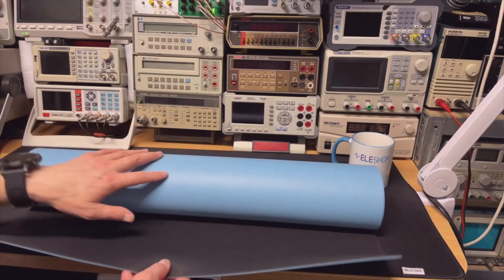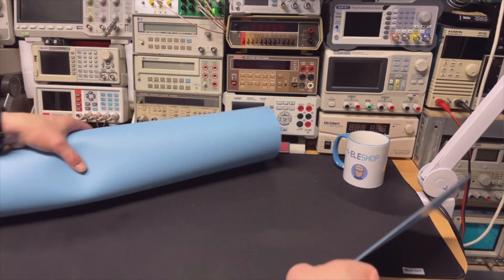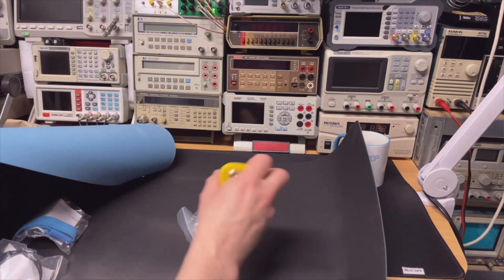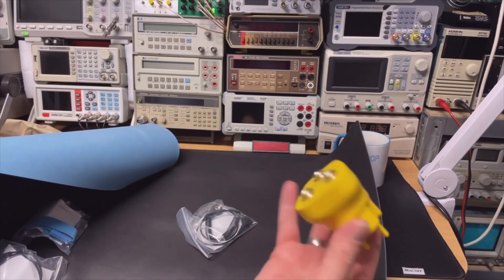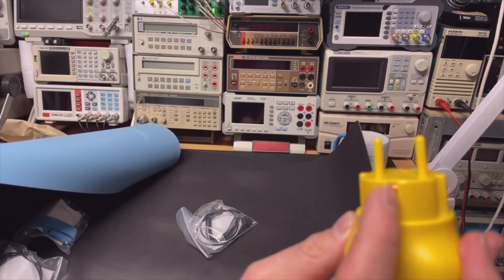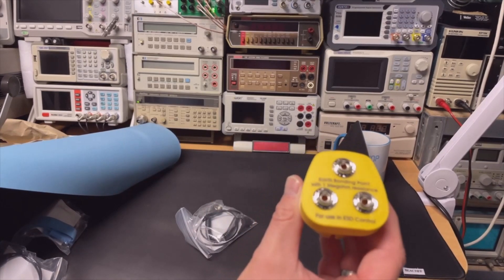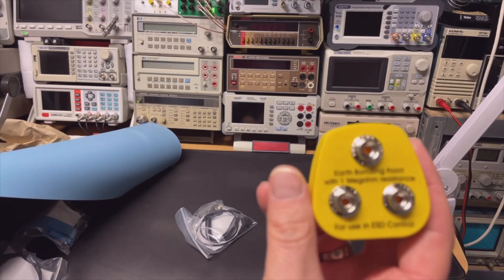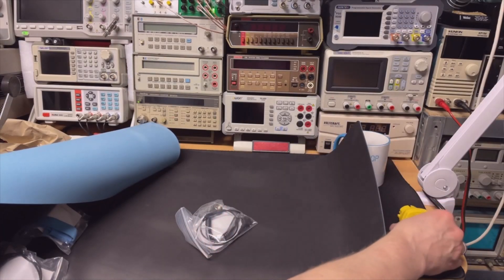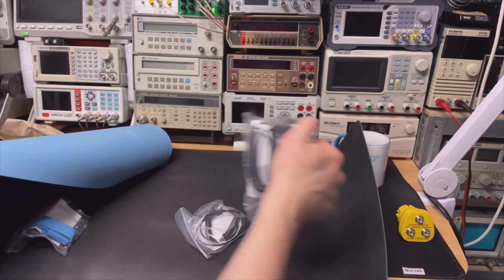Let's see what we have. This looks very nice. This is conductive and that's why you cannot build up a charge, and of course you need to connect it to the ground. Here we have the plug, and this is really plug and play because you just put this in your socket and it will just be connected to the earth connection, to your ground. But it is not directly connected — it is connected with one megaohm, so you don't get electrocuted but it is enough to not build up a charge. And one of these cables is flexible so that it is nice on your arm with the bracelet.